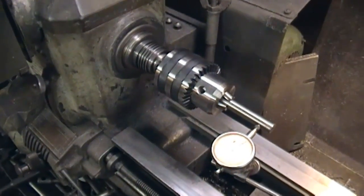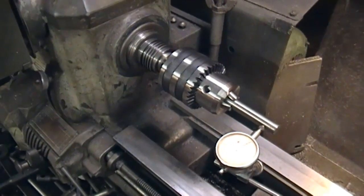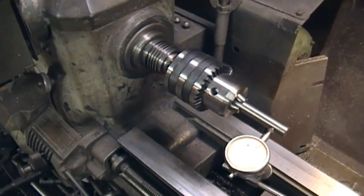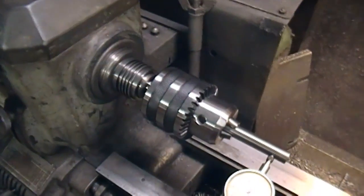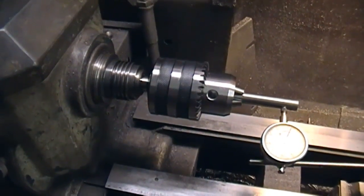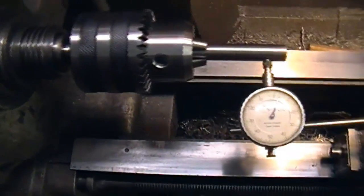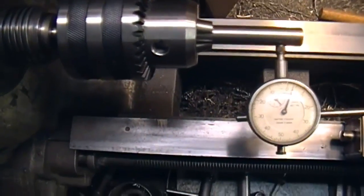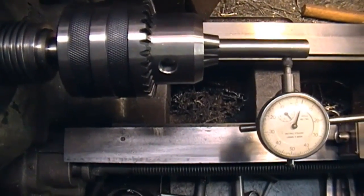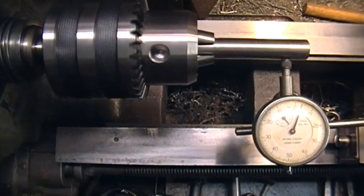Well, so much for me forgetting about the Morse taper in the spindle! As I said, it's a number four and I've got a four-to-two adapter here — which isn't necessarily ideal for absolute perfection and truth, but anyway. I've put the light to the side of it so you can see, and I'm doing it just handheld — it would seem this is in about the same ballpark as Lawrence Harrison's test.